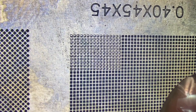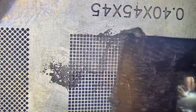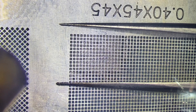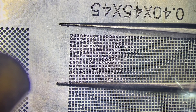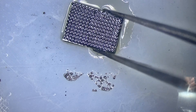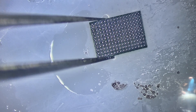I'll take a stencil — just a generic stencil that fits the same grid — and take some solder paste and evenly distribute it throughout the stencil. I'll come in with heat at about 300°C, nice and slowly, to get an even re-balling on this IC. This is what it should look like when you're done. I'm going to clean up the IC and get rid of any of the burnt flux.